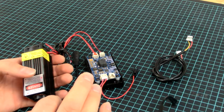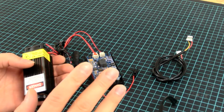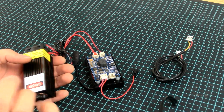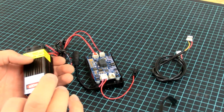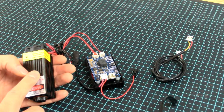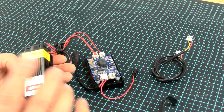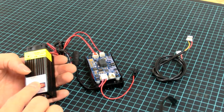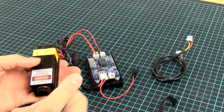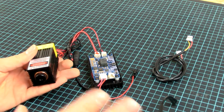That is the reason why I will build an enclosure for this machine, fully closed and with a kill switch for the laser power in the door. So it is not possible to have the machine running or to have the laser running when the door is open. So this is my insurance that no radiation or laser light will get out of the box.